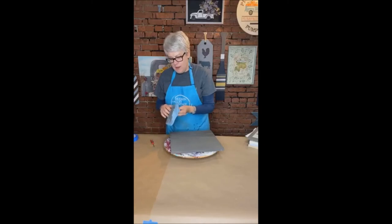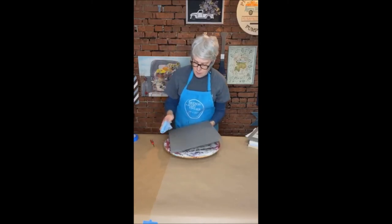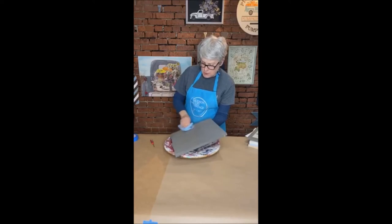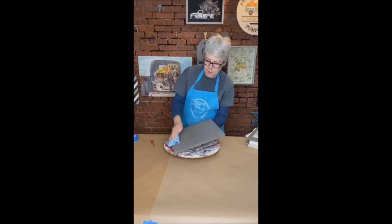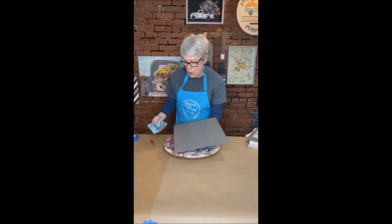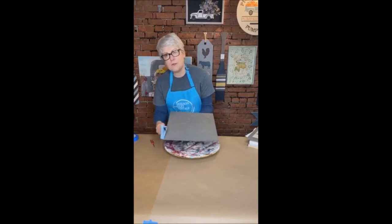Now you don't want to wait. I've had a couple of people, not with this product, but other stains, that for whatever reason, didn't wipe it back, and it just kind of sat there and it gets tacky and doesn't dry. Takes a long time to dry. Yeah, so guys, if you're using a stain that requires you to wipe it back, I think most stains do, don't they?